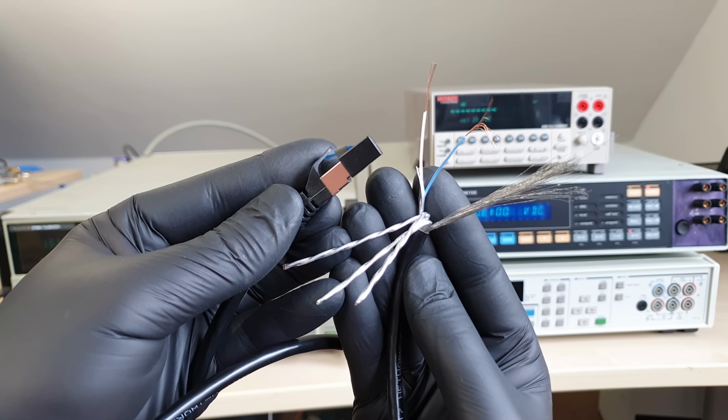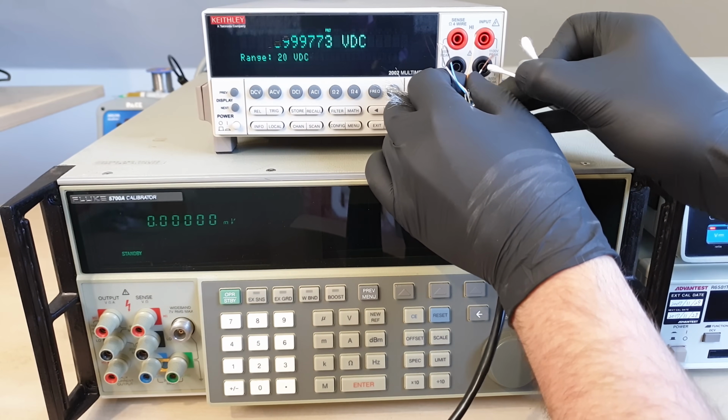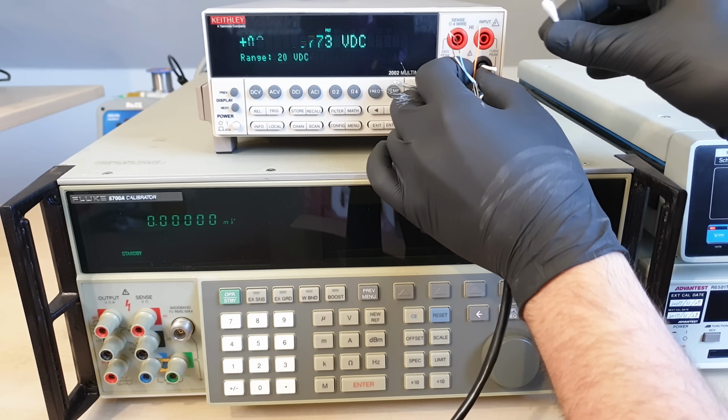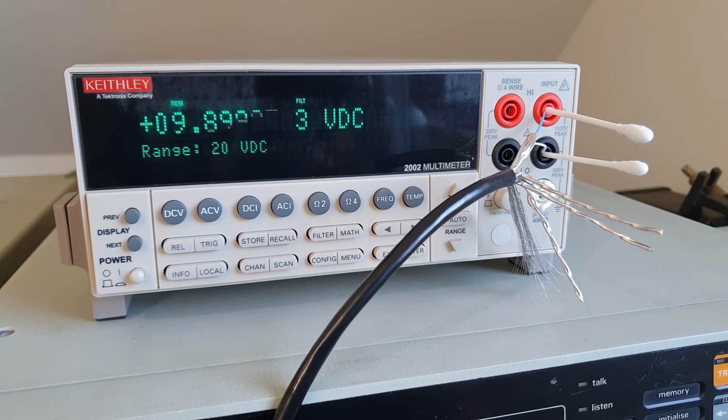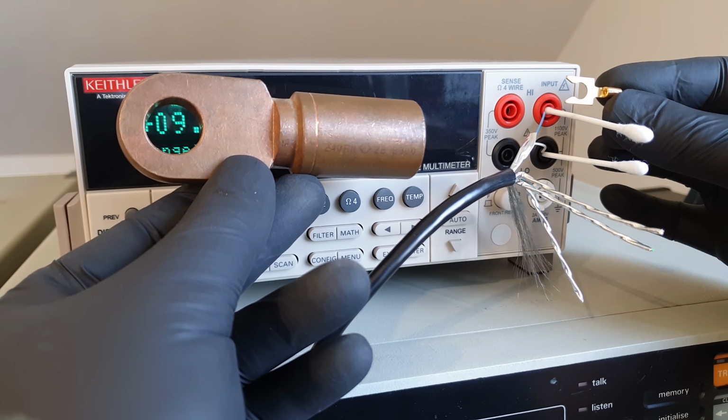Ubiquitous Ethernet cable is usually shielded quite well, and the super thin pure copper data lines, in combination with some metrology grade Q-tips, make excellent low thermal EMF connections. When there is no thermal mass, any temperature difference won't last long.